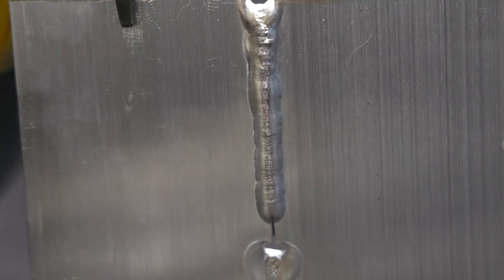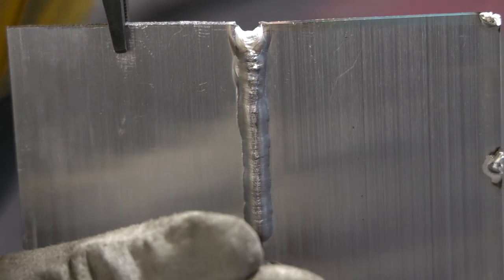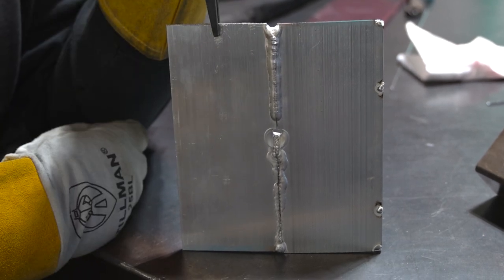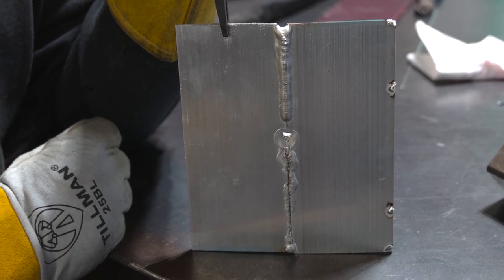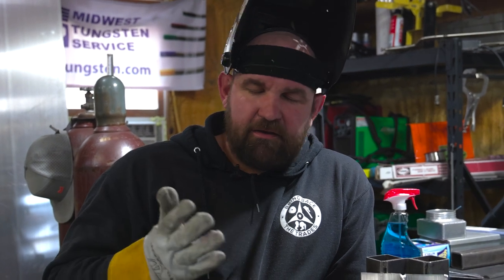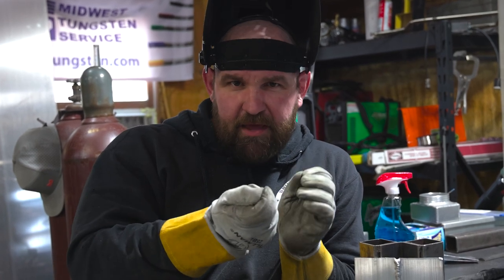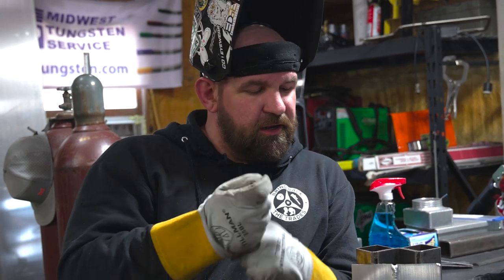Nice, even, balanced tungsten angle — not leaning your torch to one side or biasing to one plate, just right up the center. Filler rod right down the center on that front edge, watching it keyhole open and then jamming a little more filler rod than you would on flat. But other than that, it's pretty much like running flat. That was a nice little overhead demo. Like I said in the beginning, it's like running flat, just in a different position — which sounds like an oxymoron, but once you do it a couple of times you start learning that yeah, it's just like running flat as far as your torch angle and technique. You're just watching that keyhole and jamming a little more filler rod into it.